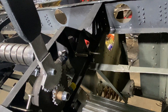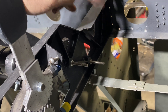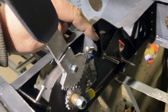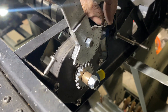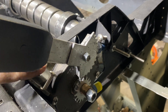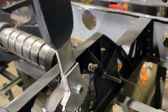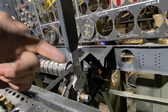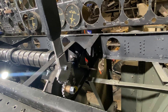These things are all-encompassing — the nut plates are going to be mounted all around in here. Something I just realized is these guys right here: I couldn't figure out what they were by looking from this perspective, but eventually I figured out that these are actually adjustable stops. This one's not long enough, but it functions. In theory, if I had the proper Teleflex cable I could link this one with the one in the pilot's console.